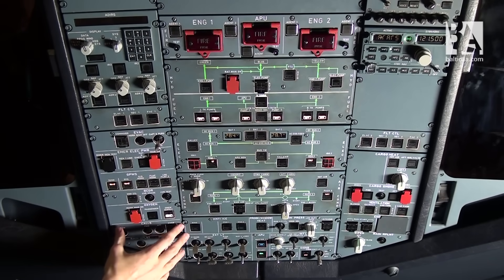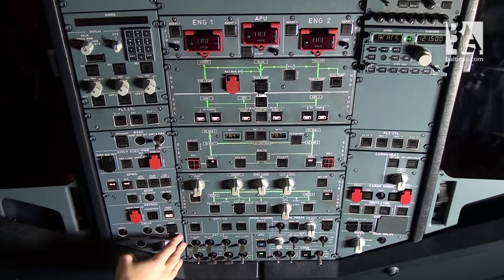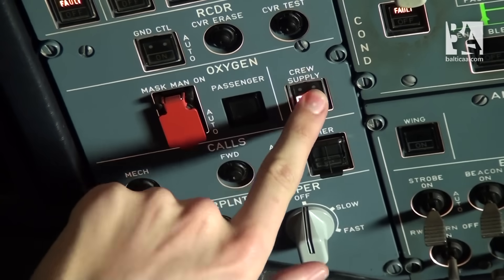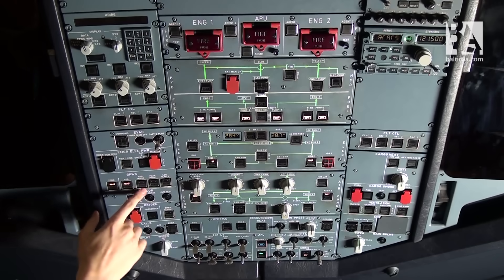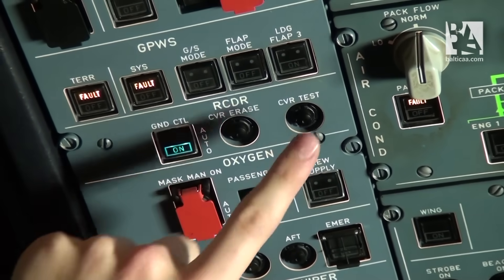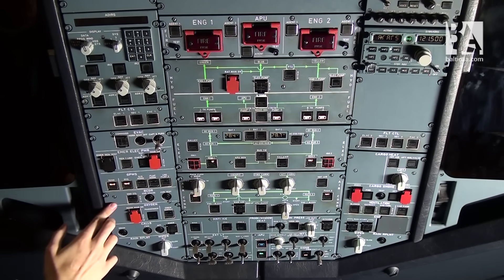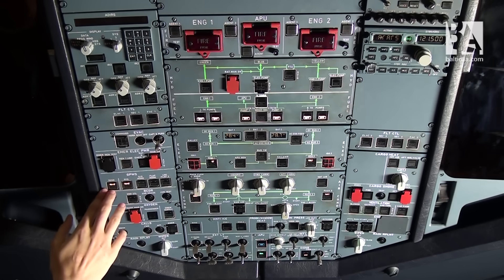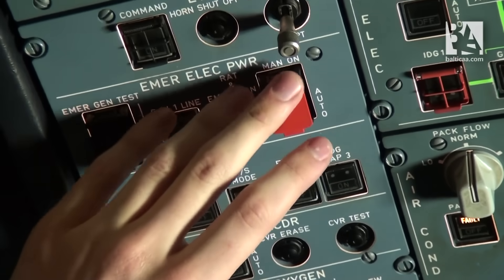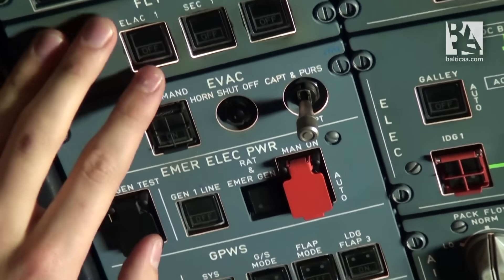The main purpose of this overhead scan is to test a few features, to enable a few, and to extinguish all the white lights. We start with the crew supply light — no light, it's good. Now we test the recorder, the flight data recorder. We select ground control on and test it. We hear the beep, everything is all right. We have a fault but it is absolutely acceptable because we are now on the ground. Emergency electric power panel is okay, evacuation good, flight control computers are good.